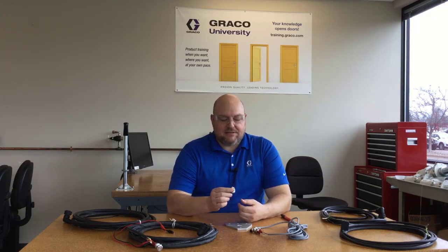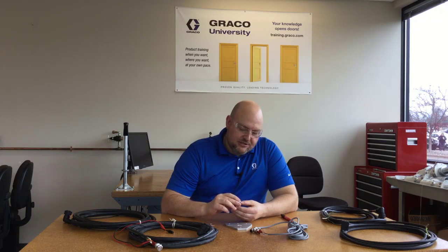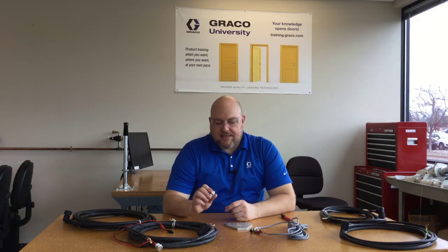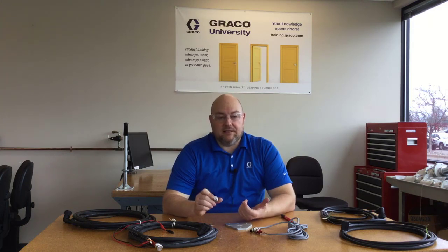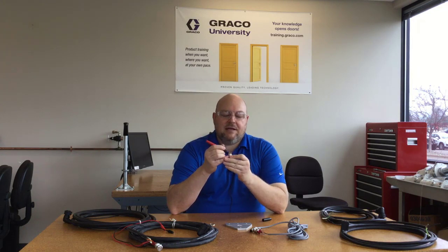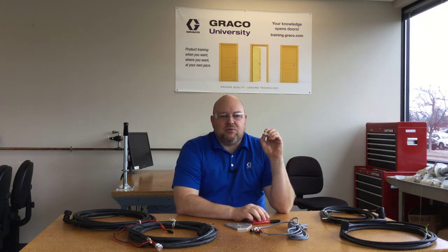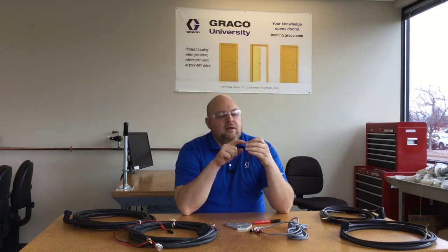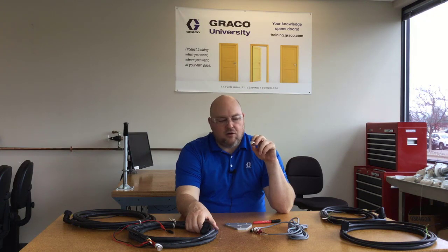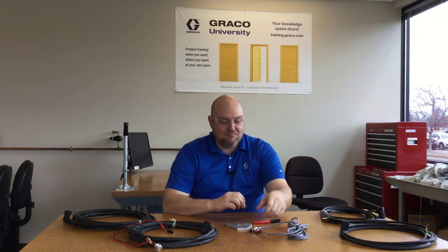There are really tiny numbers on the back of these push buttons, and a constant complaint is that the numbers are hard to see unless you're in direct sunlight. My tip: before you go into a workspace that isn't well lit, take a black marker and find number three, then put a black mark on it. That way you can tell which way it's oriented and use the manual to find the other numbers. I like marking three because on the CPCs, the black wire goes to number three on both the G3, G1, and Electric Grease Jockey.